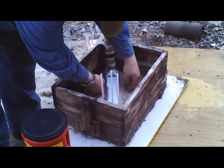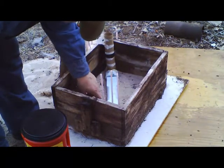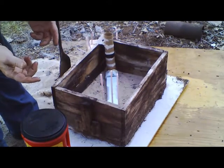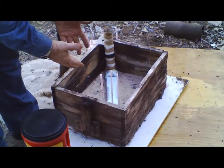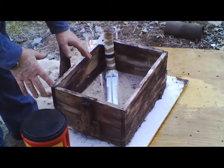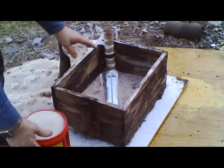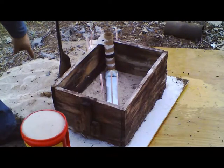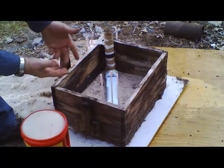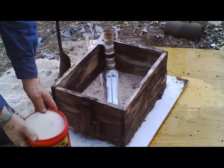If you're in doubt, just slide your hand in. You don't want big rocks in there. Another thing — swipe the wife's sieve, preferably a screen sieve, so when you're reusing your sand all the lumps get broken up. I can't find mine. Now here is clean sand — this is dirty color over on the side because it's recycled, pre-used sand. It's going to get burnt, dirty, and clumpy, so you'll have to replenish your sand from time to time.